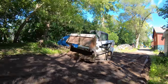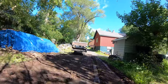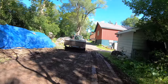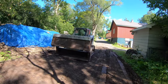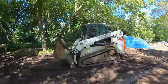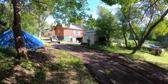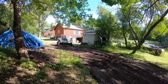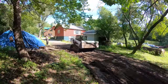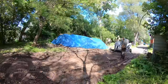I know over in Europe they use them all the time. You don't see them that much here in America — on all the job sites I've been on, I rarely see these things. You can see that four-in-one bucket. He should have put the nose down right there — it just bites really fast. One of the tricks with the four-in-one bucket is the fact that you can't see your cutting edge. When the bucket raises up and you want to use it more like a dozer blade, you're almost completely blind. You have to actually go by feel, and if you're not used to the feel of the machine, it's going to be a little difficult. A lot of times a guy likes to visually see how he's doing with his bucket edge, but there are times when you can't do that, and with a four-in-one bucket that's exactly what's happening — and that's what's throwing Alex off.